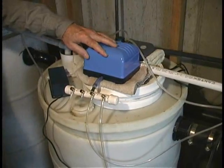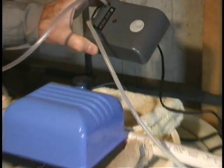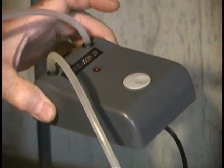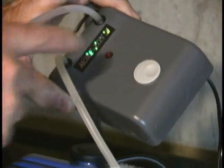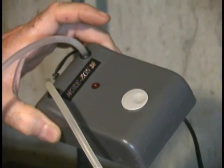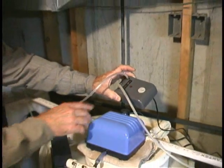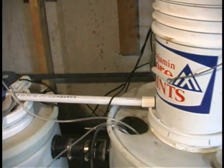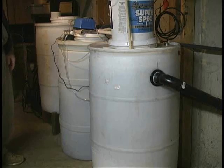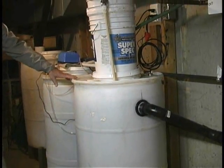This is a little aquarium air pump. This is an ozone generator — it just hooks up to the air pump, you pump air through it, it passes a corona discharge, like lightning in nature, that produces ozone. This hose then bubbles that ozone through the water, and that's a sterilizer. Ozone kills bacteria, and then this overflows into the next one.